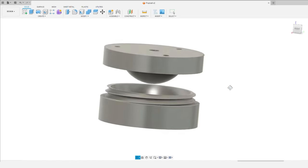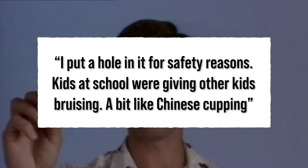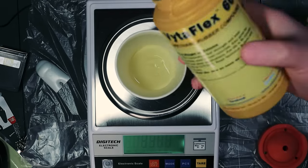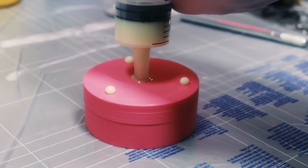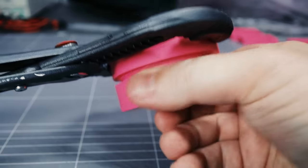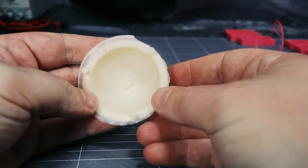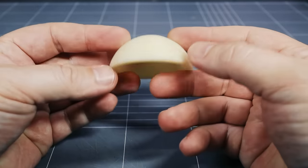Next up, I thought I would try some DIY injection moulding using 3D printed moulds. I didn't include the hole in the pop ball because that was where I was going to inject the rubber. Peter Fish had also told me that the hole is not critical to the performance of the pop ball. I'm using polyurethane rubber that I'm familiar with from past projects — it's easy to work with, has a good pot time, cures in less than a day, and makes very durable parts. I used a precision syringe to inject the rubber into the mould. The following day I removed the flashing and opened the mould. Things were looking good, but my mould design wasn't great and I struggled to remove the pop ball. I got it out eventually and was happy with the finish, and I also poured a sample for testing. It turned out that the polyurethane rubber was softer than I expected and the end result was lacking that pop.